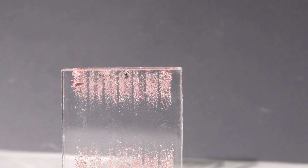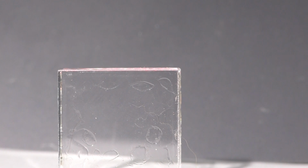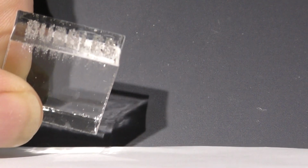So perhaps the first thing I should do is raise the height from 25 to 28 millimeters. In other words, I'll lift the focus 3 millimeters out of the material to see whether or not it'll drag the pattern upwards. This one is frequency of 75 with a 45 nanosecond pulse. We're using 100% power and 1500 millimeters a second, and we're now 3 millimeters above the work with the focal point. And it actually looks quite nice on the surface as well, doesn't it? So now I'll go the other way and we'll go 3 millimeters into the material.